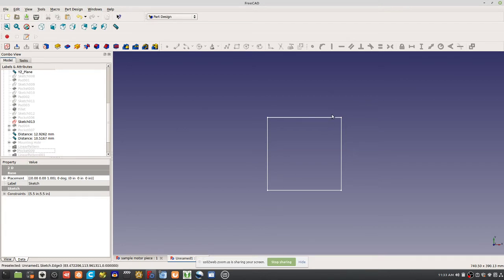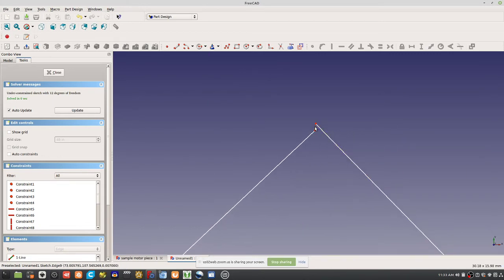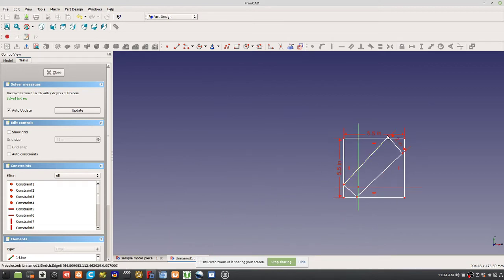Well, if you print on a diagonal, you can actually get more than 5 inches long. So what exactly would that be? Because if you're limited by print bed size, we've got to optimize for it. So let's take a look at it. Say this is our printed piece. We wanted this to be like, say, 2 inches, right? Because the current axis pieces are like 2 inches or so? So say we had to do 2 inches, would this fit any better? So 2 inch, oh, it's hardly fitting anymore.